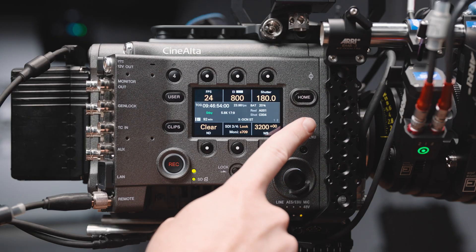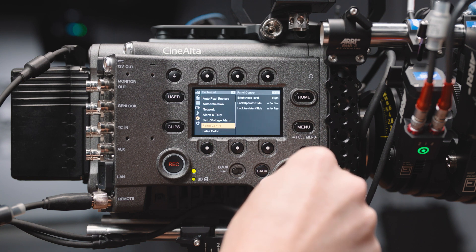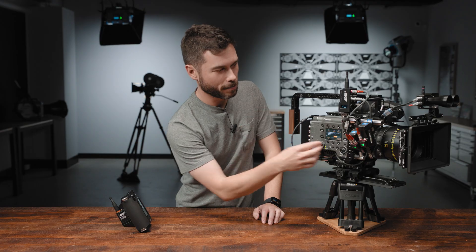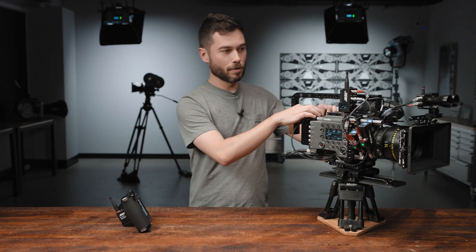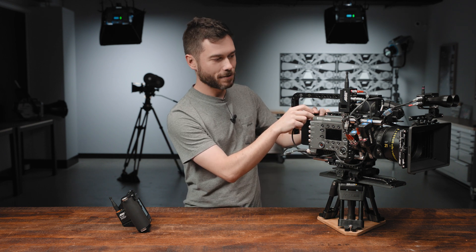I go to full menu by holding down the menu button, then scroll down to Technical, then all the way down to Special Configuration, and then turn that RCP paint control setting to on. The camera will do a factory reset, so save your user setup if you go into this mode so you can reload it later. Then press Run. That will take about half a minute to reboot the camera. I'm also going to reboot the RIA1 because the protocol has now changed — when the camera starts booting up, I'll turn the RIA1 back on. I'll then have to recalibrate the lenses because the power has been lost to the motors.